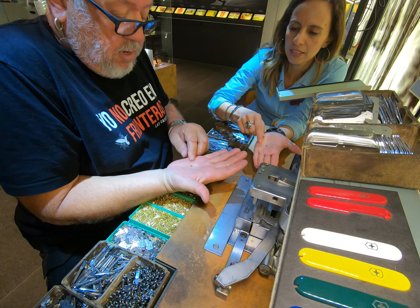Next, get a washer and place it, then add the small blade over the washer. We use the pedal again to make everything fit — step on it, pull up and keep it up. This just takes the pressure off the spring. Then the last divider goes on and you step on the pedal once more.